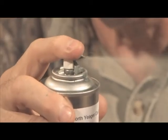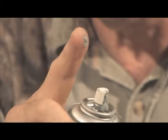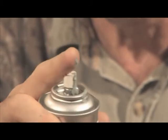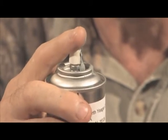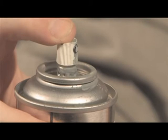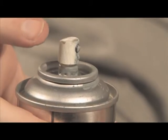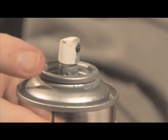Ensure that your finger does not overlap the actuator. This will cause paint to build up on your finger and ultimately lead to large dollops of paint being deposited on the weapon, creating surface defects and an uneven finish. Please be aware that some paint can build up on the actuator from time to time while spraying. Wipe away any paint buildup so that the force of the spray does not deposit the buildup on the weapon.